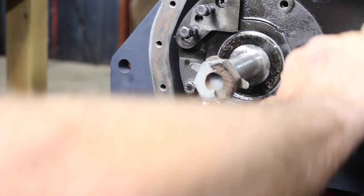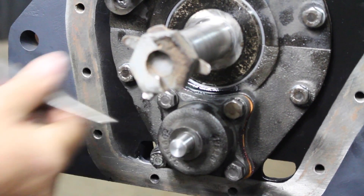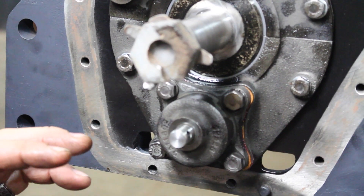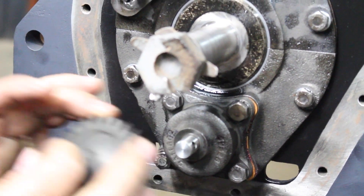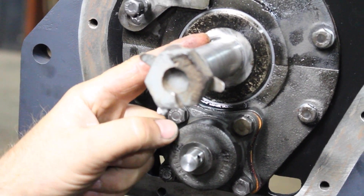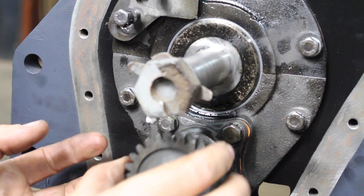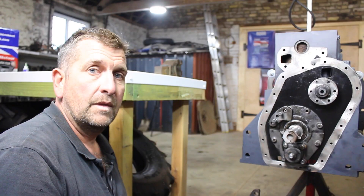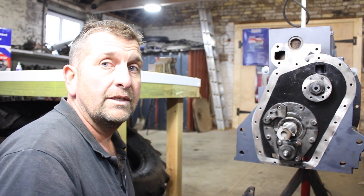Within reason it's pretty much the same job if you wanted to do this on a Ferguson TEF20 — you just need the little rotor and a gasket. Here's the pump fitted. We've got the other end of the shaft sticking out here — put a screwdriver or something in there and just make sure it turns nice and freely, which it does. When I took the pump off we had a sprocket and a pin to go in, but I'm not going to fit those at this moment because I still have to fit the chain sprocket and then the drive sprocket. It'll be easier to fit those in another episode when I fit the sprockets. That's just a short little video on rebuilding and fitting the oil pump — I hope you enjoyed it, please leave a comment and I'll get back to you as soon as I can.